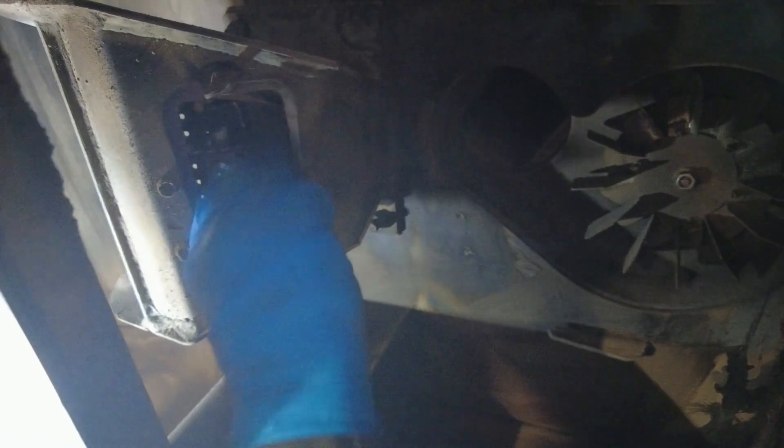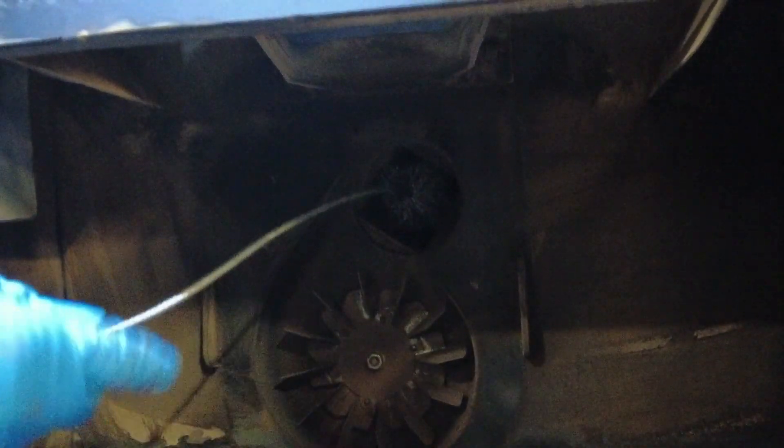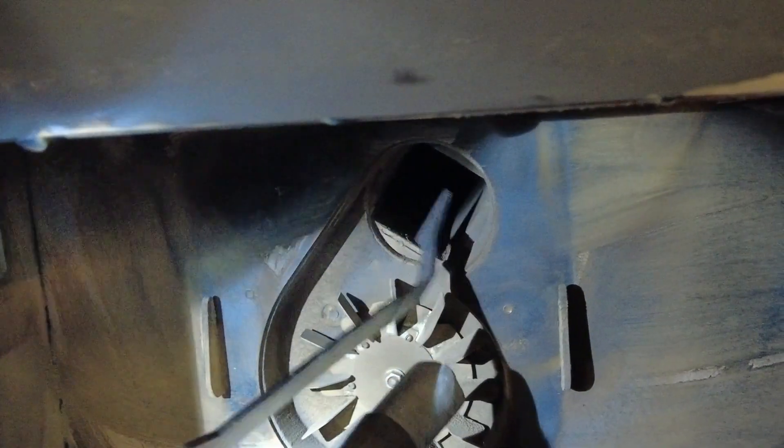This is a vacuum attachment with small holes to get into tight places — she's vacuuming around the bottom where soot builds up. That's where the primary air going into the burn pot comes from; it goes up through those holes. Looking through the exhaust you can see the ESP probe — it's nice and clean, so nothing to be overly concerned about. You can remove it from the other side if needed, but we use a soft wire brush and push it back toward the exhaust probe carefully so we don't damage it. We vacuum out any residue that falls. Alicia also likes to use the scraping tool that came with the unit to scrape that chamber.